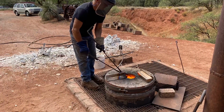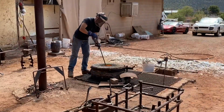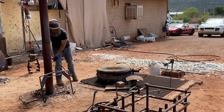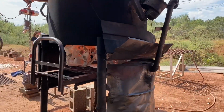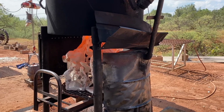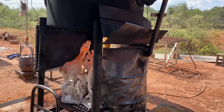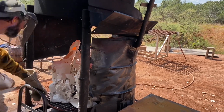And then it's pouring day. So here's Rob melting the bronze and making sure that it's the right temperature, and it's really, really hot. It's molten. Meanwhile, the ceramic molds have been put into a kiln and fired, so the outside becomes really hard and all the wax inside is melted out. So they take these directly from the kiln and set them up.